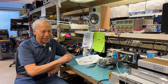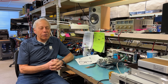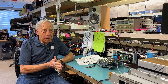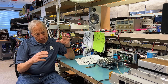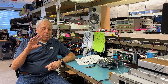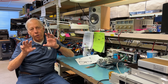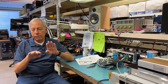Well, that's a lot of questions. It's so easy to get confused, and I'm going to do my best to try and untangle some of this for us. The most important part of the relationship between a power amplifier and a speaker is voltage. The power amplifier has to output a certain amount of voltage in order for the speaker to start moving back and forth and make sound. More voltage, more sound. It's as simple as that.